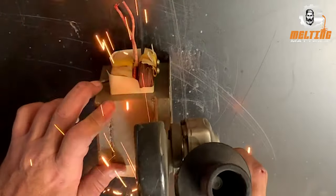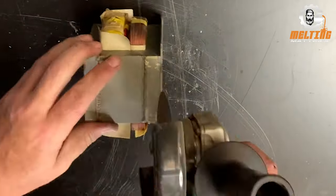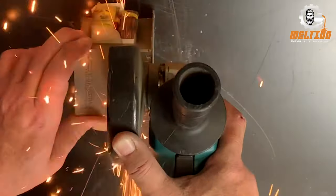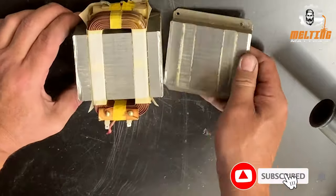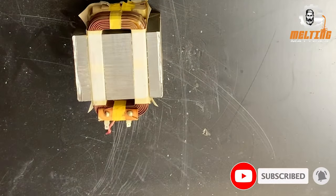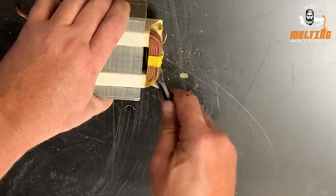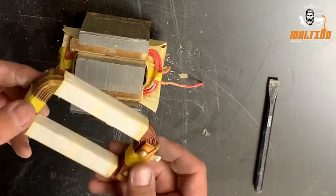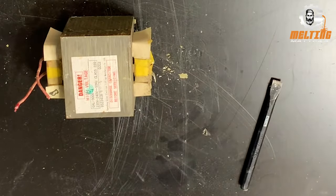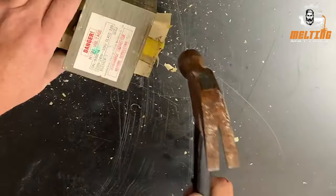As you can see in the video, I'm just cutting off the transformer trying to access the primary coil, which is the thicker of the two main windings. There is a third winding in there — it's a three-volt circuit but we're not going to use that, we're just going to concentrate on the primary winding. I'm levering it out carefully, trying not to damage the laminate, which would result in a short circuit of the coil and make it unusable.